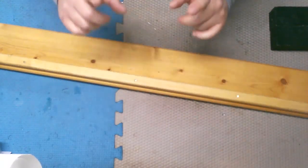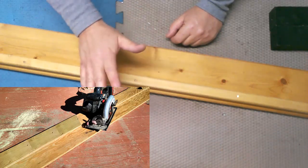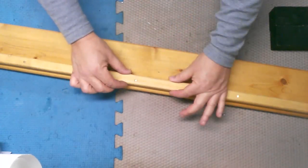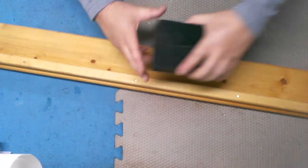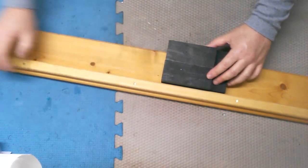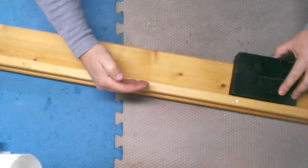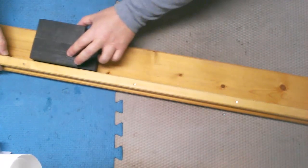There are various different videos on YouTube that explain how to make a track saw out of wood - that's where I got the idea, but I made it better and I'll explain why in a minute. The track saw is very simple: you have an edge board and a bottom board, and the saw rides across the track like that, giving you a nice clean cut because the edge keeps the saw always on the line.